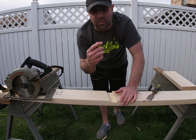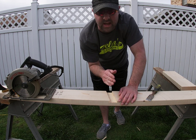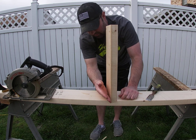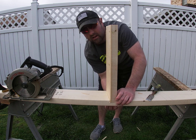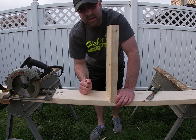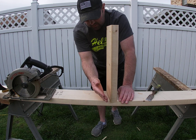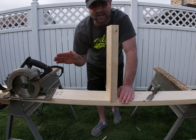You can even take a piece of sandpaper, wrap it on a block of wood, and sand it — it'll get it nice and flat. Basically what I've done is I've created a channel for that step to go in, and that's a really nice tight fit. That's something I did with the circular saw, and then I'm going to add a couple screws from the outside in and that'll make it really secure for the kids. This step is on the angle that we figured out earlier when I took the level and made that cut line.